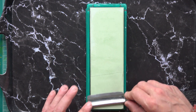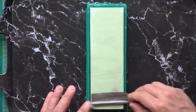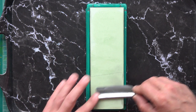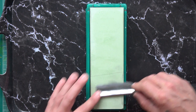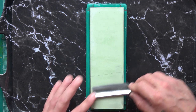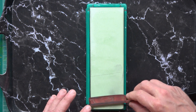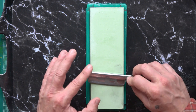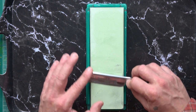But I quite like doing the V-laps. A bit more concentration's needed in a way. It just goes to prove you don't need great big long stones, isn't it? Like, 3-inch stones is all you need. And I remember reading years ago that the little Japanese finishing stones were small, so you could only do little laps. And the reasoning behind that, supposedly anyway, this is what I've read, I can't really confirm it, is because the smaller the laps, the less chance of any form of burr or wire edge. What I have read as well is because it's meant to concentrate the mind.